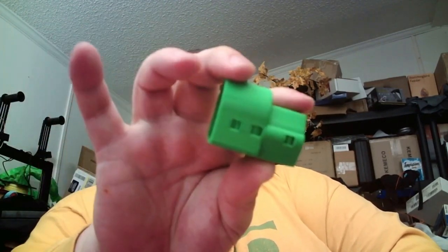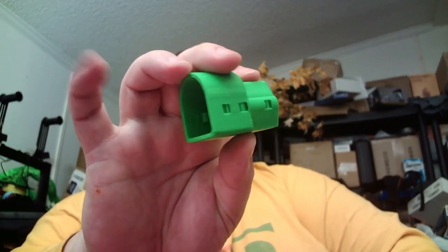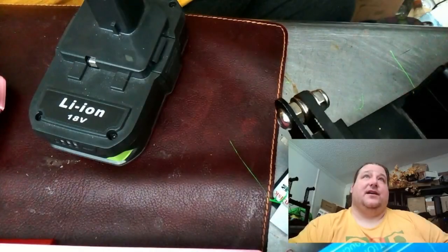This required no support. You do have to use variable process for layers — well, you don't have to, you could print the whole thing at 0.12mm — but to take two hours off the print time, I print three-quarters of it at 0.2mm and then the rest at 0.12mm, because bridging up here to close these threads is not going to work at 0.2mm. You really want to be at 0.12mm, and make sure your parts-cooling fan is working well.